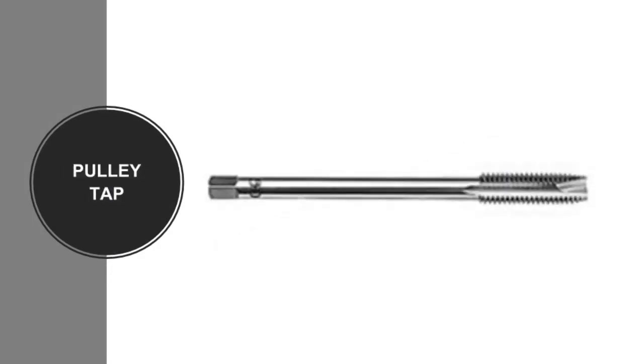Pulley taps: the hub portion of pulley parts contain oil cups and set screw holes, most of which cannot be reached with ordinary hand taps. Pulley taps have the same basic thread dimensions as hand taps, but differ in that they have a longer shank which is of the same basic major diameter as the threaded portion. When tapping pulley hub holes, the taps are inserted through holes in the rims which are slightly larger than the shanks of the taps. These holes serve as guides or bushings for the taps to assure proper alignment. Pulley taps can also be used for general tapping in parts where an extra long length is required.